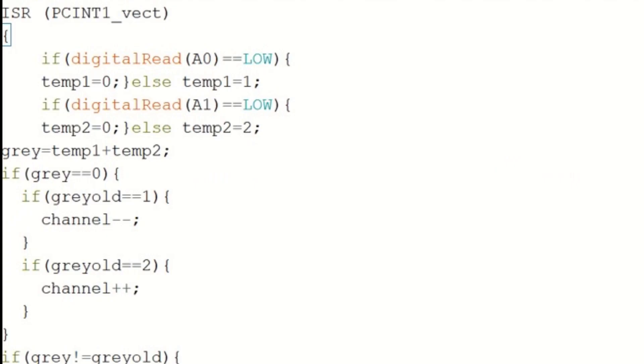After these changes it seemed to run fine — the display worked and the SI5351 output the appropriate frequency. The next step was adding the encoder. I wrote a function to handle it, first without interrupts, just to see if it would work with the menu and channel selection controls. When I uploaded the sketch, the upload went fine but the Pro Mini would not display anything. After trying many things and double-checking the hardware diagnostically, I found the problem: when the sketch took more than 80% of available space, the program would not run. So I stripped the menu system and simplified the code so all options need to be set in the source code before upload.